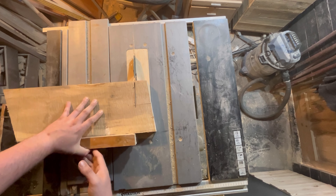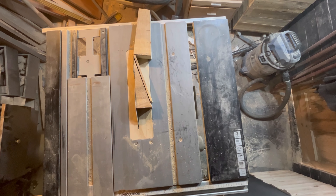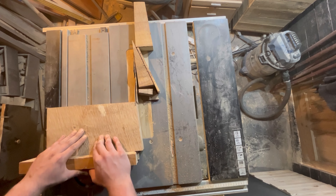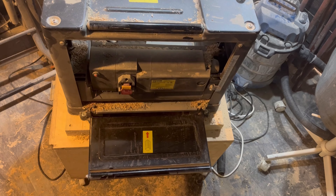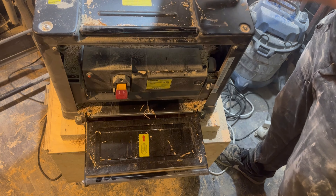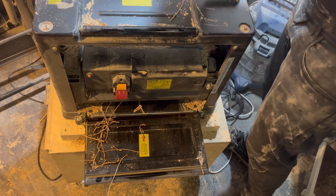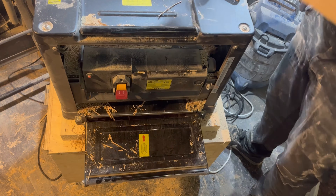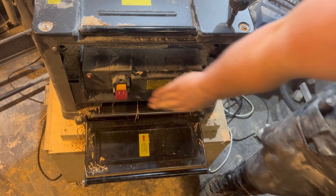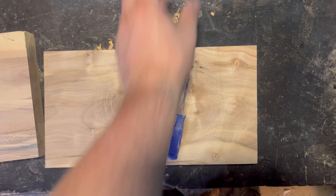Here I am just cleaning it up. There were a few cracks there, so I wanted to get rid of those. Flip it over, do the same. It was a bit of a shame I couldn't really do anything better with this slab, but if I didn't make it into these little boards, I wouldn't be able to use it for anything. We've taken it over to the surface planer now, and these are the sort of chips you want to see coming out the back — it means your blades are nice and sharp and it's taking a nice cut. Because these boards are so small, we can just shove them in and they come out pretty much perfectly flat every time. If you're doing longer boards, you might want to make up a little jig to keep everything flat.